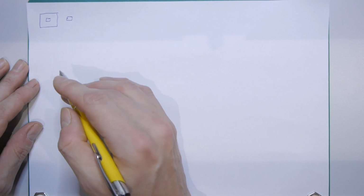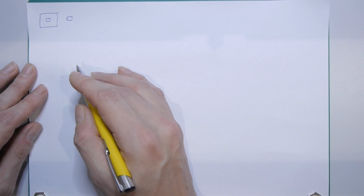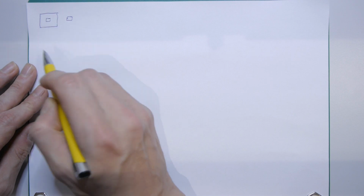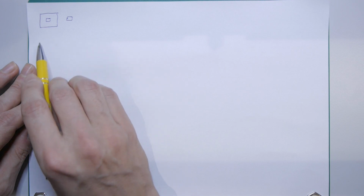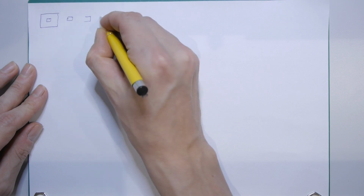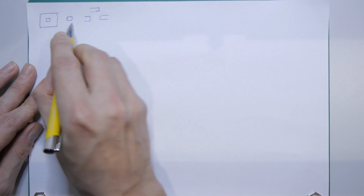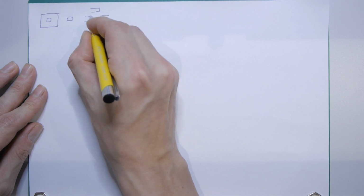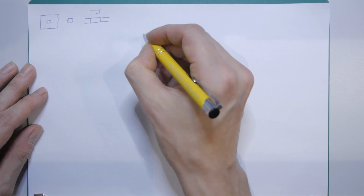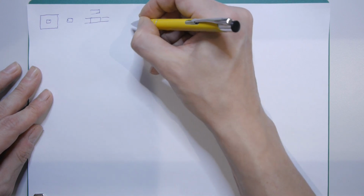This can work. This is the method I'm using when I make my bezels for the gauges, but when you want to come out with a perfectly tight fit here, then this couldn't be the method. Because when we look from the side here, we have the cutout. You would think then your piece would now come into here and sit flush. But this is not how it works. When we cut out something with a laser, then the edges would look like this.